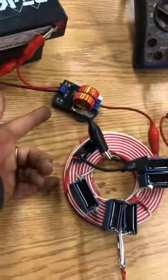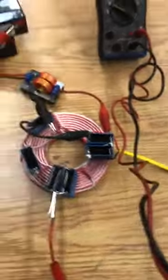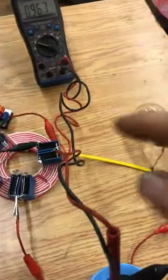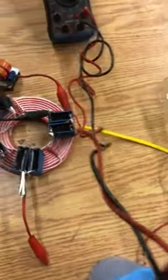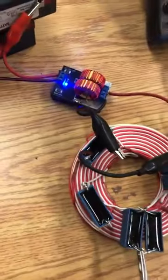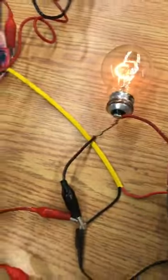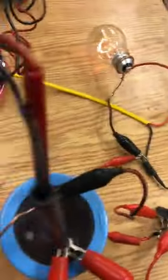I'm only putting a few tiny watts in here using some tiny batteries, but I have the voltmeter hooked up on the capacitor so you can get the DC voltage. We have a 120-volt 100-watt light bulb on there. The ZVS has come on, the light bulb is lit — certainly isn't full brightness, but it is lit. It's being rectified and put into the cap. We have 51 volts in the cap, and this bulb lights as well, somewhat.